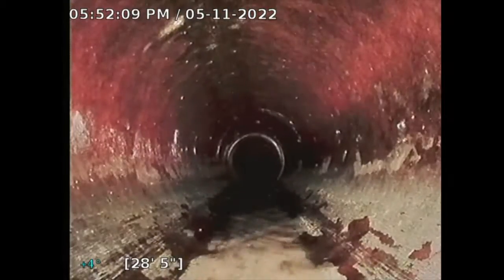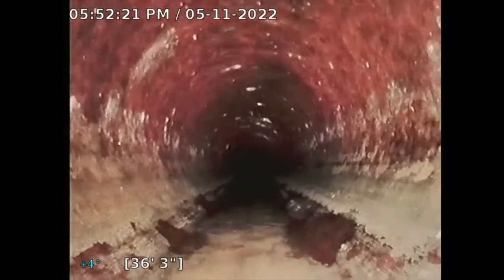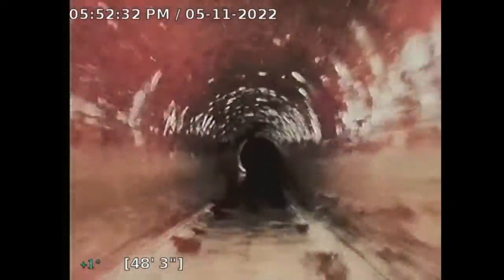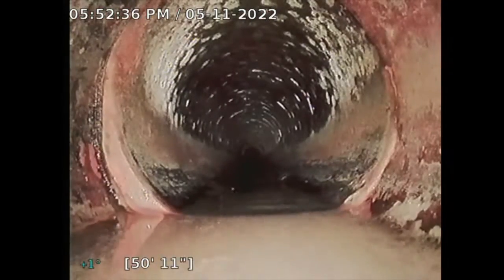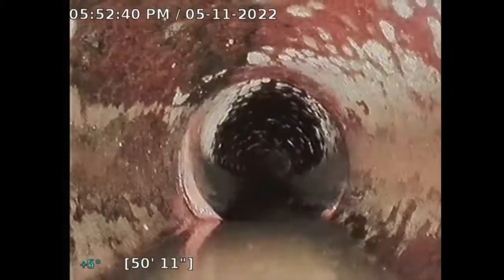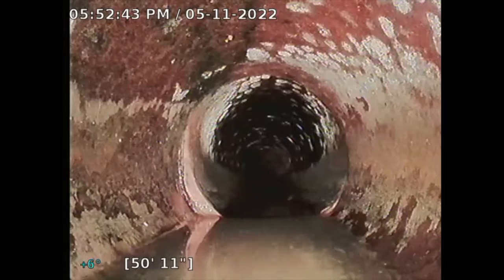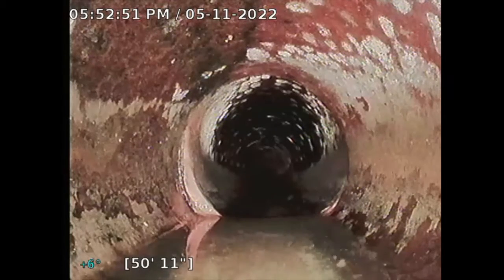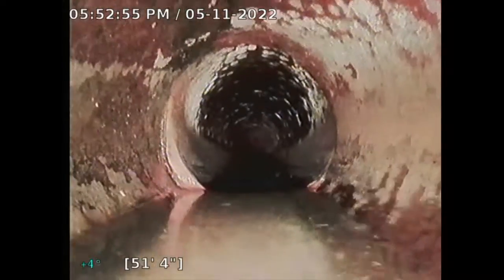See how the water is just kind of trickling — now I'm getting better slope. I think that area is flowing. So far the sewer line is looking pretty good. There's a little minimal joint offset — you can see it on the bottom left and the top. The proximal pipe, or the pipe close to us, has maybe dipped down, and the distal pipe looks like it's lifted a little bit. There's a little joint offset on that.